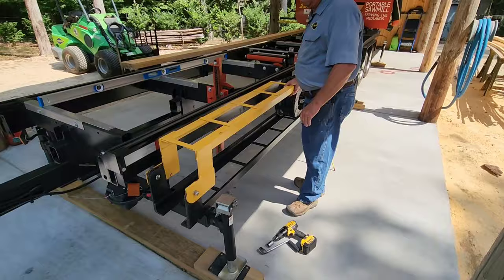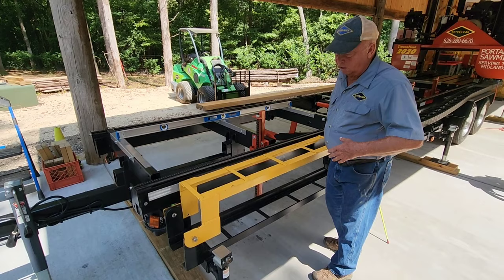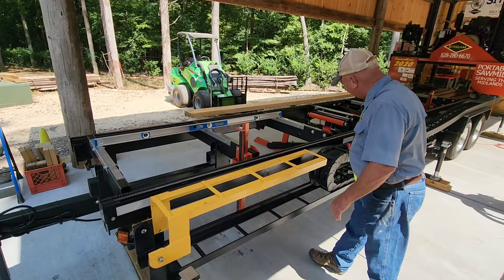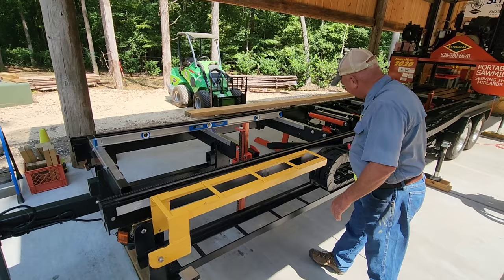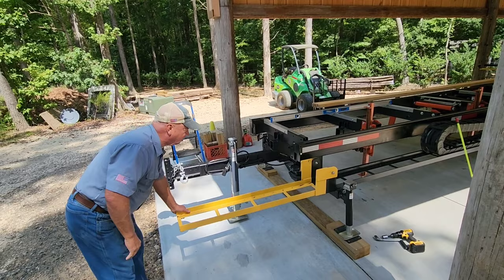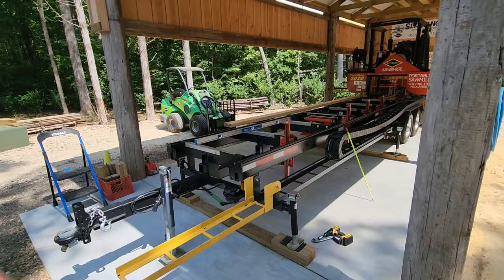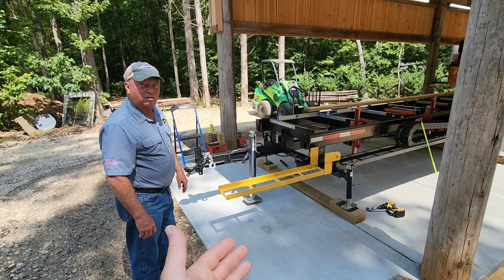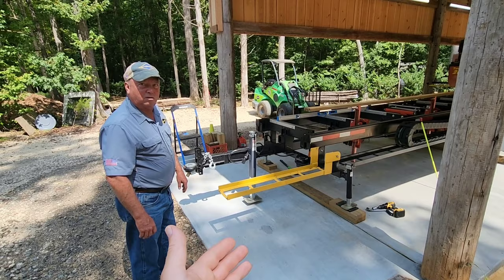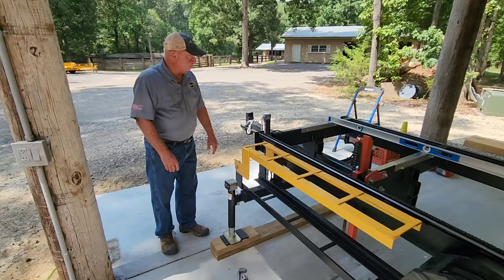This little deal here is not something you're going to find on any of the Timber King mills. I ordered the machine with the 12-foot extension, and very seldom will I be using a 12-foot extension. Standard from Timber King, the energy chain would roll to the end and just flop down on the ground — I didn't much care for that. So I came up with this little flip-over deal, and it's painted yellow so I don't forget it. This allows you to cut the full 21-foot length of the sawmill without letting your energy chain get on the ground. And the energy chain, if you don't know, is $75 a foot — so if anything breaks or busts those, that's $75 a foot. That's quite spendy.